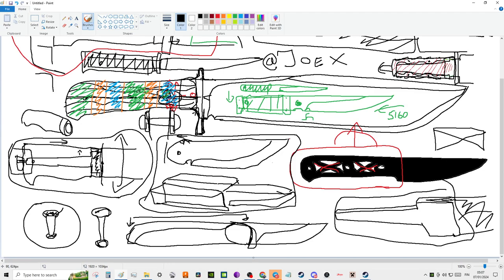So if you want to do a takedown blade, your best bet is going to be a full tang, right, where your scales are kept on with screws. You might be able to do it with a frame handle, right? But again, you're going to need some kind of pinhole that goes in through the side to keep it in place, because those threads are not going to last forever. The screw's going to get loose. Things like that will happen.